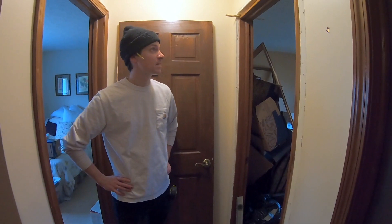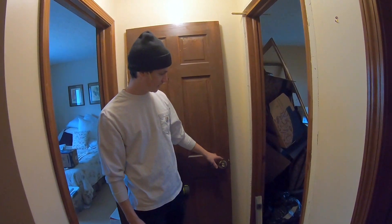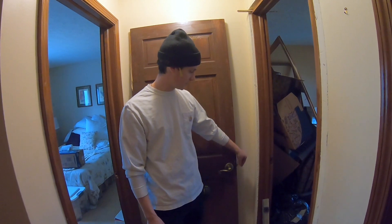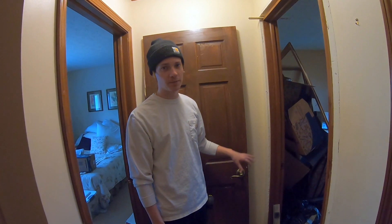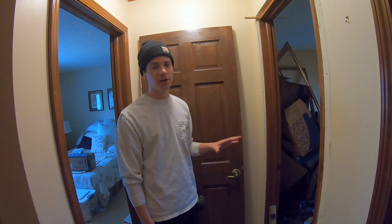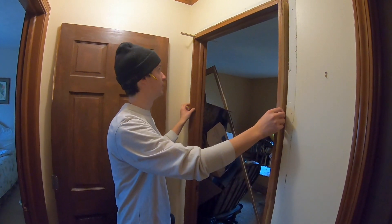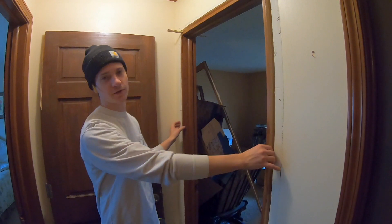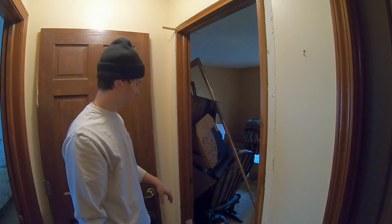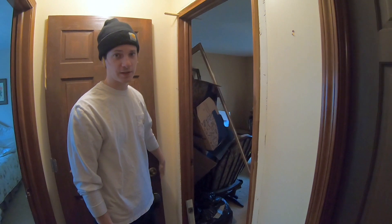There are a couple different doors you can buy at a hardware store. The first is just a regular solid door — typically they don't have the holes drilled out for the handles, locking mechanism, or any of the hinges, though sometimes they do come with those. That is a non-pre-hung door. The second is a pre-hung door, which comes with a door jamb. These are really useful because you know the dimensions of the door jamb are going to be correct to the door you're hanging. They typically come with hinges and holes drilled out for handles and locking mechanisms. Today we are going to be doing a pre-hung door.